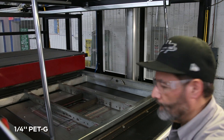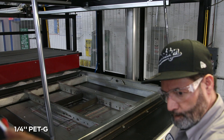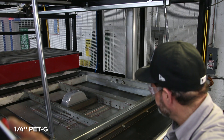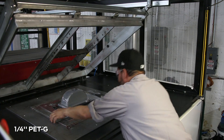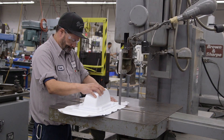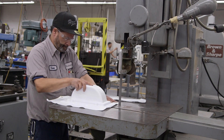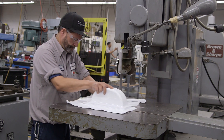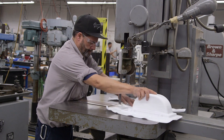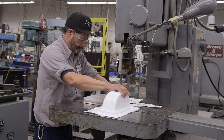When examining your final parts, look out for slight imperfections such as deformation or webbing that can occur when the plastic is overheated, stretched, or left on the vacuum forming platen for too long. After you have successfully molded your object, any extra plastic will have to be cut away — this is called flash. Industrially this material is cut away with a computer controlled cutting device, or manually as shown here.